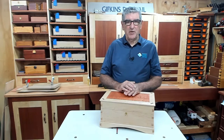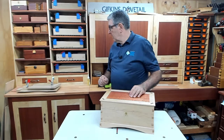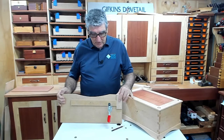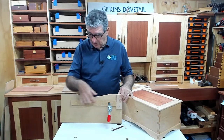And one of the things that we did last week was we built a jig to work on the plinth and to get that curve on the plinth. Now, this is the jig that we built. So that's the jig we built. Got a backboard support end stop, and that was nice and square. This is for those people who didn't see the show, and a toggle clamp on there to help hold the material down, because it's going to be a long piece of material that goes on here, which is the plinth piece.